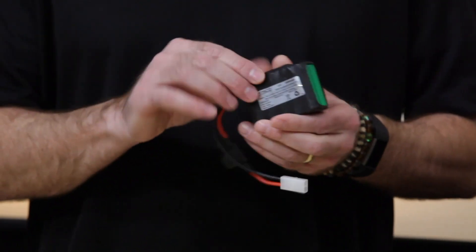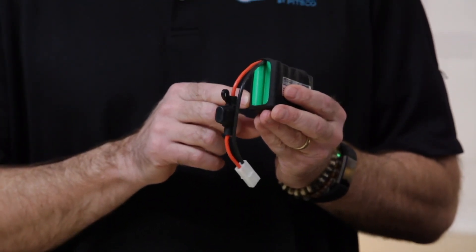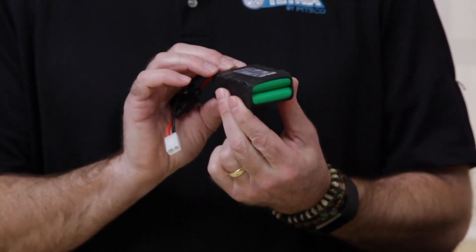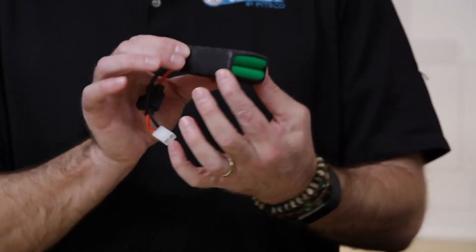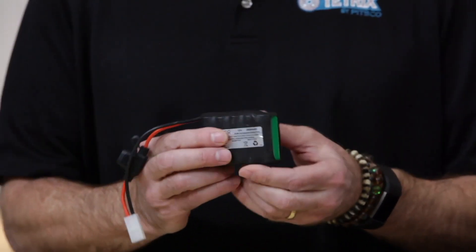What's the difference between this one and the one in the middle? Actually it's got the same number of cells — it's a 10 cell pack just like the other one, but this one has AA type cells in it. So they're physically smaller, which allows a lighter weight, and we can fit this in tighter spaces. If we're building a smaller robot where we need the room, this is a great solution. It's a 12 volt pack just like the other one, but it's a 2,000 milliamp hour battery. It also has an inline fuse and the same Tamiya connector. Both of these batteries work with the chargers that are included in all of our Tetrix Max sets.